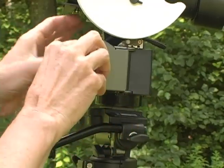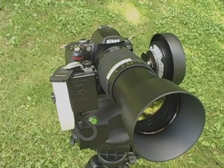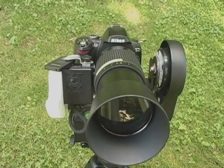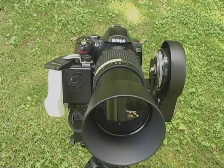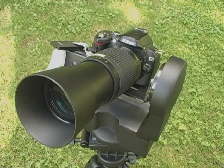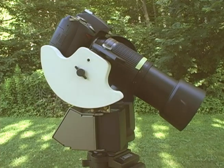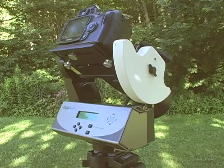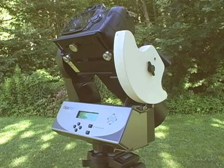All right, let's put everything back together and see it operate. Here's the Nikon D40 with a Nikkor 70 to 300 mm AF-G lens, non-VR, mounted on the Epic 100. This lens has a barrel diameter of 74 mm, and its axis is aligned with the centers of the lower pan motor and the tilt motor. However, zoomed all the way to 300 mm, it cannot be moved far enough back, even with my modifications, to place the nodal point at the double rotation point.